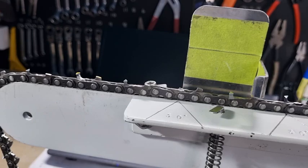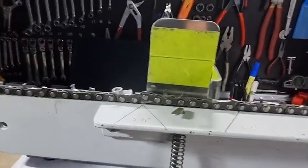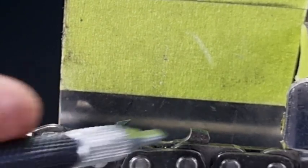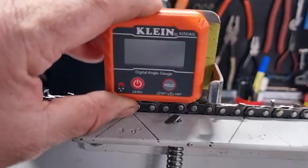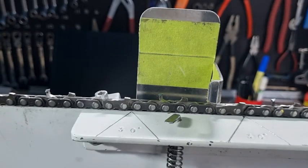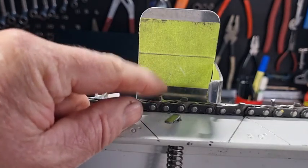If you've got a powerful saw you'll have no trouble at that angle. The problem with measuring an attack angle is you've got such a small little link — the distance between this point here and that point there is very small, and you can get movement very easily. The other problem is that when you place the digital gauge on top, it's magnetic, the chain moves with it — all sorts of problems. You can have a lot of error, so I always did about seven measurements and disregarded the highest and the lowest.